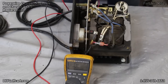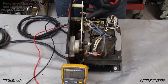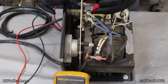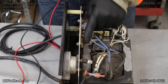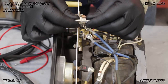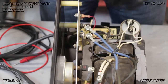Now let's check our heat sink and diode board. While we're still on the continuity setting of our multimeter, the diode is here — there are two of them located on the heat sink board. What we're going to do is verify that there's not continuity here — fantastic. That means these two diodes on this heat sink board are good. If they had been bad, this board is no longer available and you would mount a new heat sink or diode to the board and run your wires to it. But since we know these are good, fantastic.